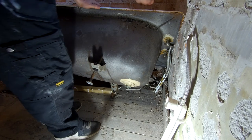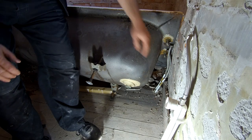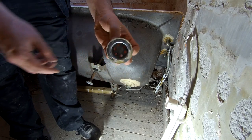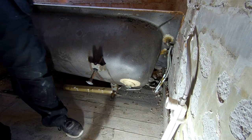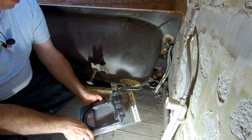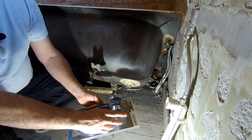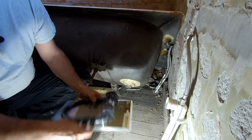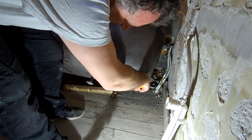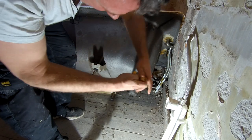I've managed to just tip the bath on its side to show you what we're doing. We've already taken out the overflow cover - that literally just screws onto the lead pipe that was in there. We've just got to unscrew the waste channel. Now we've just got a simple chrome waste and overflow. Where before the overflow went out the wall and onto the path, it's now connected up to the waste system. First things first, this nut on the bottom should hopefully undo, although it has been on here for god knows how long.